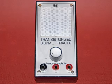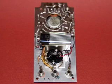I took the back cover off and turned it over. At the top is an ordinary transistorized audio amplifier. You can see the speaker magnet in the center there of the circuit board. Below that is a 9-volt battery, below that is the volume control, a few capacitors, and there's a diode in there. And below that is the connections to the signal tracer.